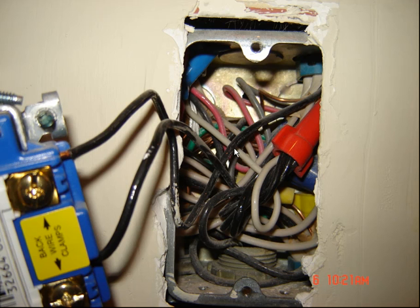In a residential panel you can use two circuits per neutral, so we've got three circuits and two neutrals in there. Well, when they pulled this in they evidently got some things screwed up. They ended up using a neutral wire in with a hot to go out and feed everything. Once I took this all apart, two of the other circuits weren't even used in there, and all the neutrals were tied together.